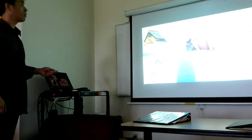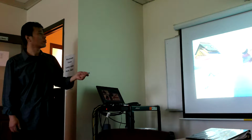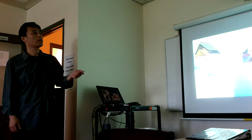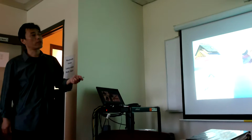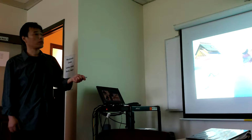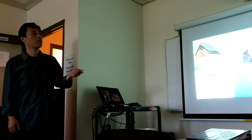And now you can see how the attic ventilation operates. Now we can see all the layers of the roof: the asphalt shingle, the plywood board, the rafter, the insulation here. And you can see the air is not still, it always moves like this. It's a typical one for a single family house roof. In the soffit, we have some screen, like that screen vent. You remember the screen vent? The cold air comes from here, through this narrow space, goes inside the attic, and goes out on the top, and goes outside.